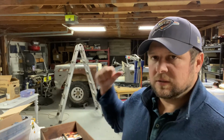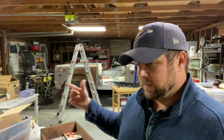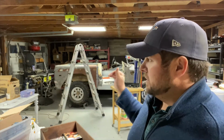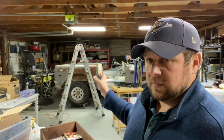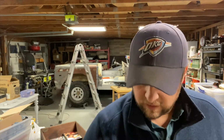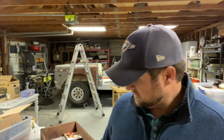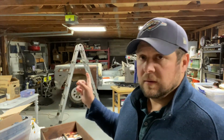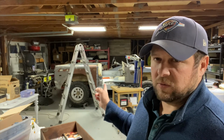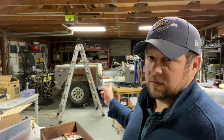But I think I may screw this front pan in to where it needs to be, because I have to make new holes, because when we pushed it in, it dropped down some. Anyways, screw in new holes for it, get that down, and then take it back out. And I think it's warm enough out here that we can paint, zinc weld this inner rocker to a certain point, because we gotta do some work back here, and recoat what we missed